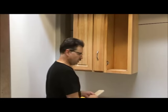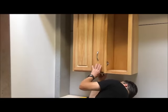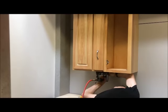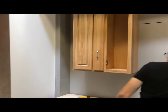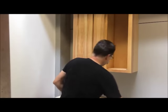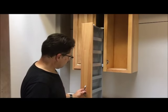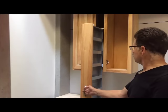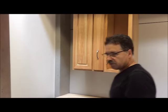Since I'm going to be putting a finished bottom on, I'm going to just put it on with the pin nailer here. Normally I'd recommend some glue. We'll just pop it in place just to show you how to put it on. Be sure you have an eighth of an inch extra gap on the sides, just like you would any door. Now the unit can come back down. It's essentially complete. With all the trays installed, we're done. Now we can just mount the door next to it.